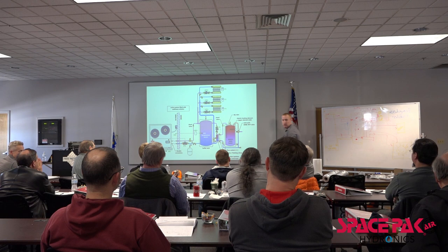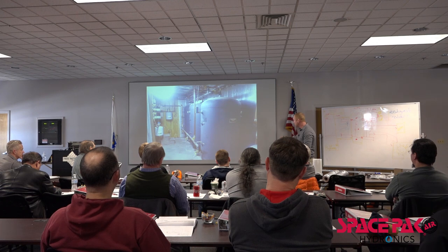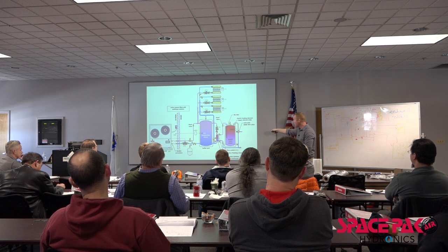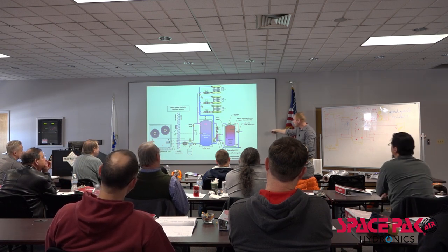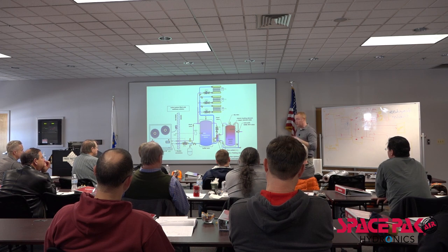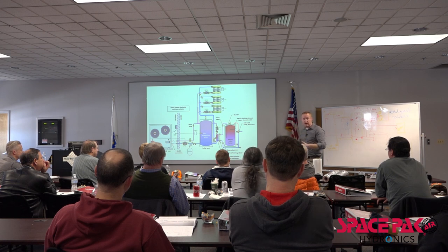Could you use an indirect as your heat exchanger? So again, what we run into, say for argument that this was a coil within a tank. You could do it either way. I would prefer it be backwards. We're still going to have a little bit of loss, depending. So what Stephen was mentioning is, if we had a tank inside here, we could have this coil and then go back out. So that would be another way to basically have an exchange between antifreeze and non-antifreeze system.